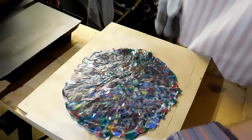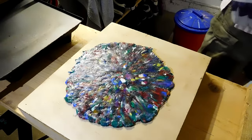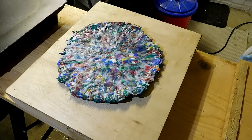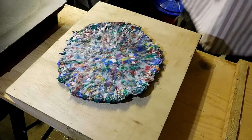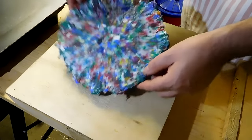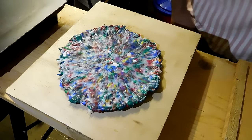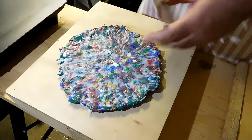I'll take this sheet off this side and then it should be more or less free. I'm going to put that on the piece of wood here, and we're going to see what happens to HDPE if it's cooled without any constraints. It's actually solid now, still too hot to handle properly and still kind of softish. But as you can see, it's gone all dimpled and crumpled, which makes it much less usable as a craft material. That's why I constrain it flat with a board - you get a much smoother surface and a thin-ish uniform sheet, although it's still prone to buckling.